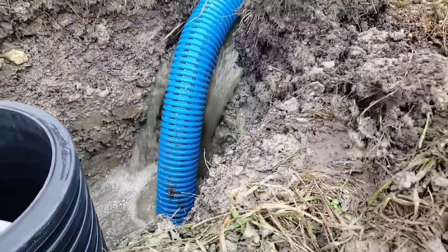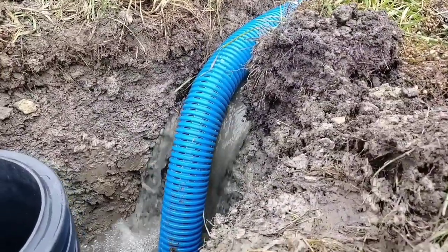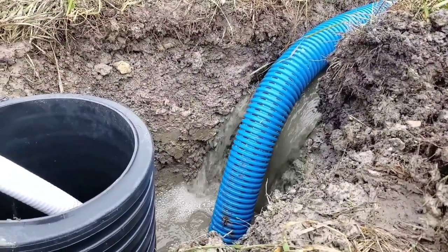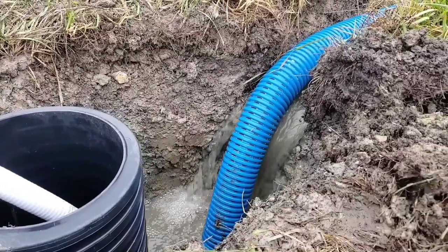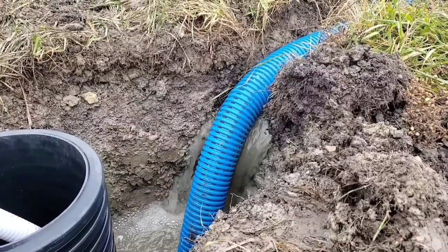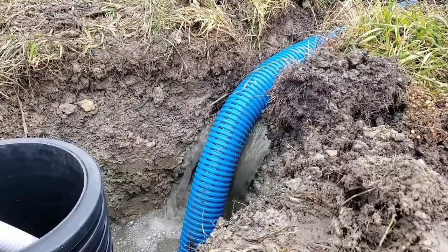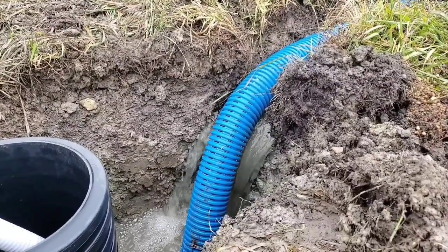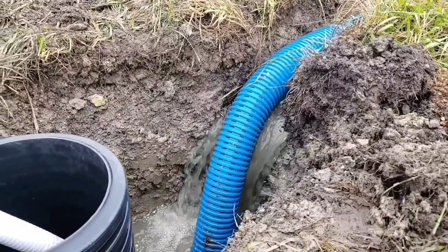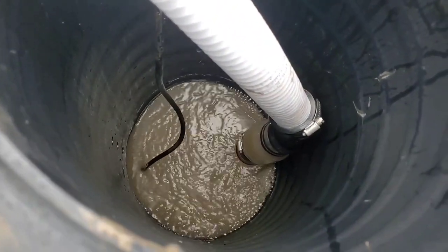If it was long and we were going across a piece of property, well, then this would be a lot deeper. And you would definitely need a full 36-inch tall outdoor sump pump system. Again, in the first example, a 30-inch would have been a fix. Go from the 24-inch to a 30-inch. That would have been enough. But I just wanted to do a little bit of an exaggeration so you guys can actually see what only a foot deeper does for you. Now, I also realized that foot deeper was a lot of digging just to get a foot deep. But the benefits speak for themselves.